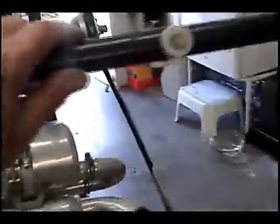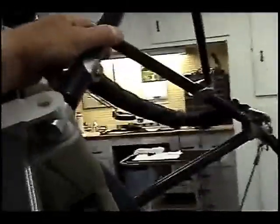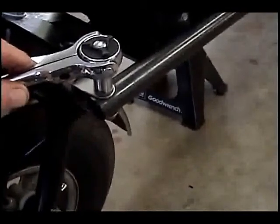We're checking every bolt and nut on this aircraft to make sure nothing is really loose. I've noticed the frame is kind of bent. The prop cage is loose — need to tighten that up. Some bolts are a little loose here and there. You go through the whole aircraft, every bolt and every nut. If they're a little loose, just snug them down. We don't want to over-tighten — just snug them so you can't turn them by hand.